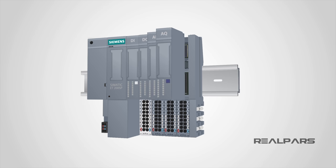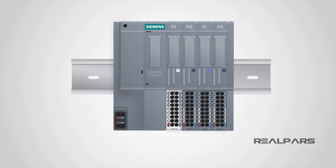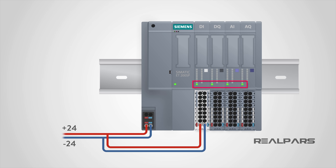You can install the rest of the cards on the base units in the same way. To power up the head module, you need to first connect a 24-volt power to the module. Then, to power up the rest of the modules in the unit, you simply take the same two wires and connect them to the terminals of the first base unit. By doing this, you'll not only be able to power this module, but the power also flows through the rest of the base units on the right, and turns on the rest of the modules as well. Bottom line, you don't have to connect any wire to these base units — just connect the power to the first unit and the rest will be taken care of.